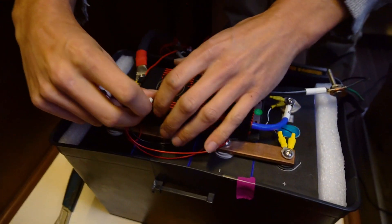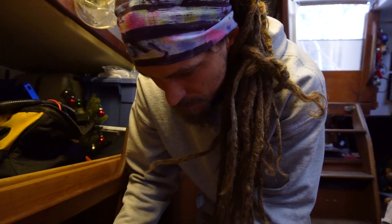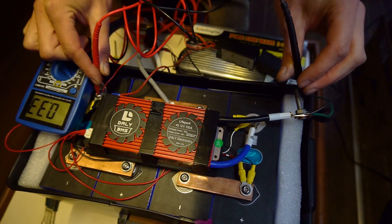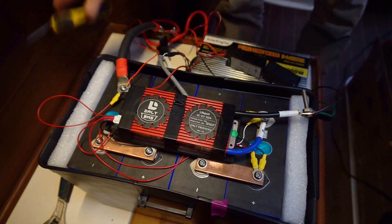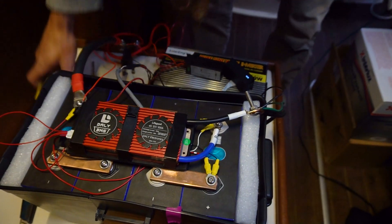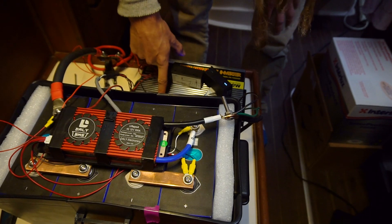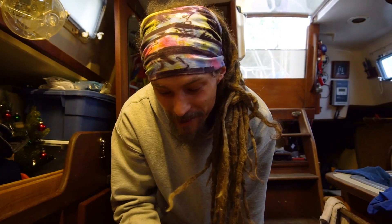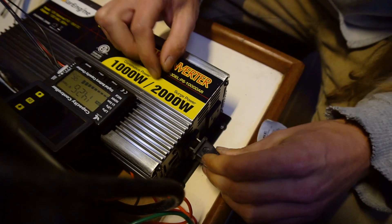We're just going to plug it in. Now I can check if there's voltage coming out of the BMS — before the BMS we have voltage, but after the BMS we have no voltage. So since the BMS hasn't been hooked up for a while, we have to short B-negative against P-negative by touching the metal together. I wasn't expecting the shock — that's what you've got to do. Normally there's not such a big spark, but my capacitor must have de-charged a little since I charged it earlier. That's why you should wear safety glasses — don't do what I'm doing. We're all hooked up, stuff is flashing, and the capacity test is going to begin.